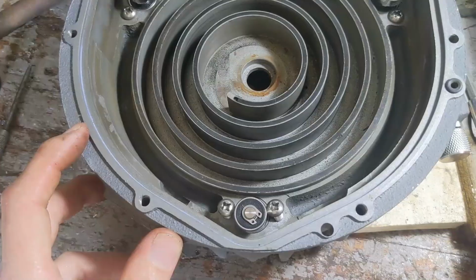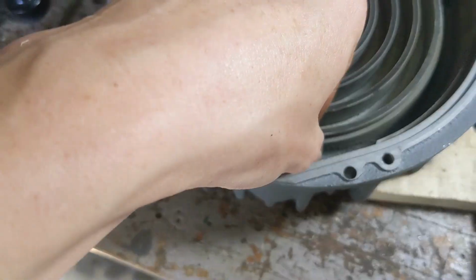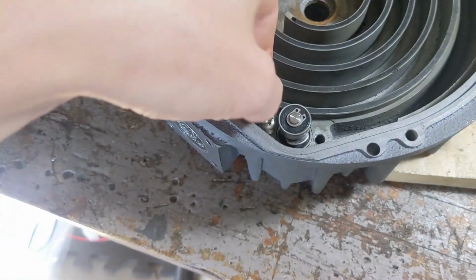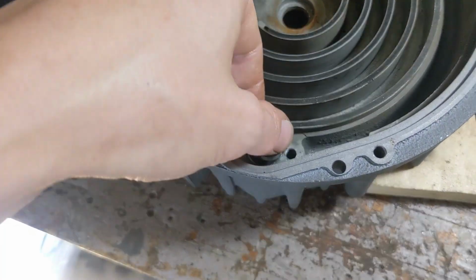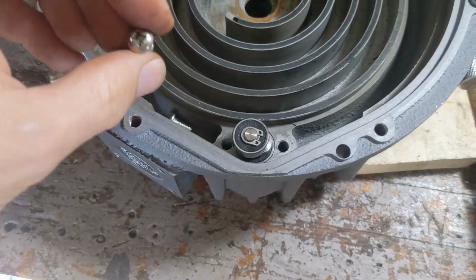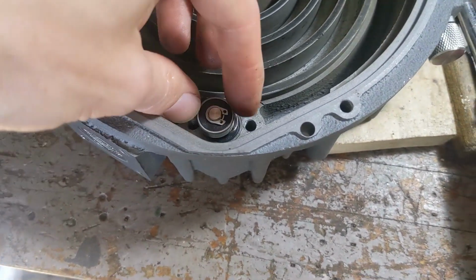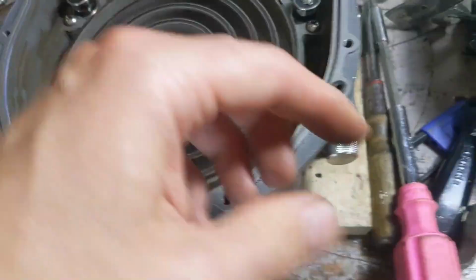What's next? Okay, yeah, this is what's next. So these crank pins, when you're doing the major maintenance, either from Harvest Right or the manufacturer, they'll send you the whole thing. And so these number 3 Phillips just come out. They might be a little tight, but you'll be fine. And then this thing comes out. This is where a lot of people run into trouble.